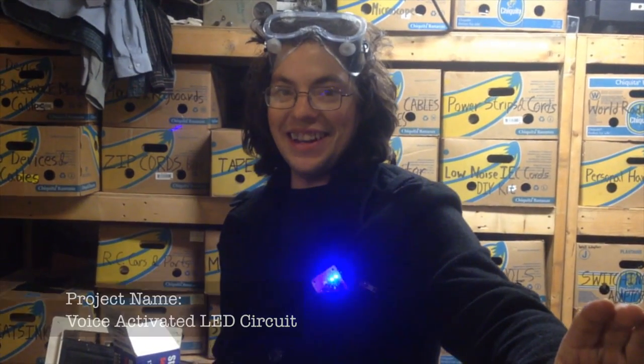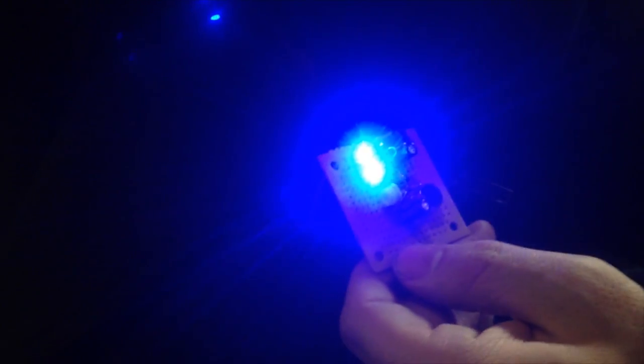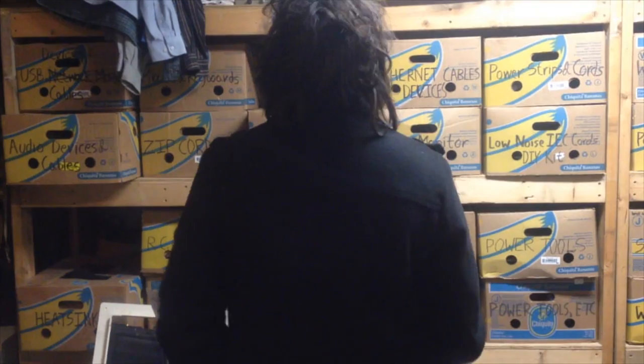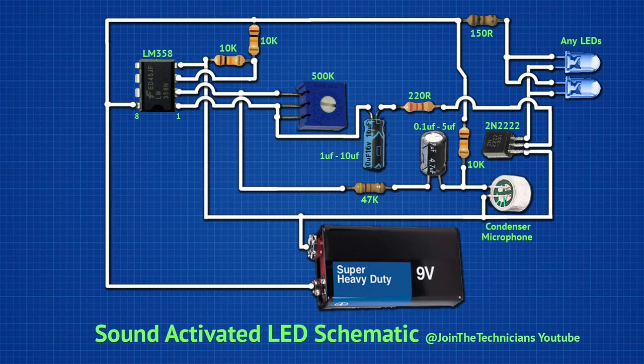Are you ready to be blinded by my voice? Here are the activated LEDs — say hello! That thing is awesomely bright. It's just powered from a 9-volt battery, op amp, and a little electret microphone. This guy with the LEDs is Chris; he's been one of the technicians since 2009. It's a simple electret microphone amplifier with LEDs connected to its output instead of a speaker or headphones. It uses the LM358 chip and it's pretty easy to build.